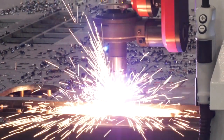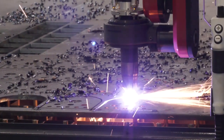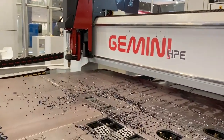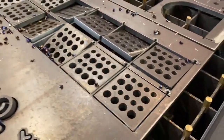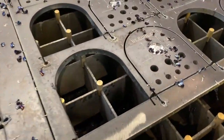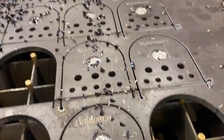Because it's quicker to drill a hole than it is to plasma cut one, isn't it? That's correct, but it's due to the quality we have to achieve on the hole and the standards in steel construction that we have to meet. Drilling gives a perfect cylindrical hole, without the conical shape that results from plasma cutting which is not ideal. I understand — plasma machines aren't quite as capable when it comes to cutting to tolerance as you would get with a drill or an end mill, and you're doing some circular interpolation in there as well.